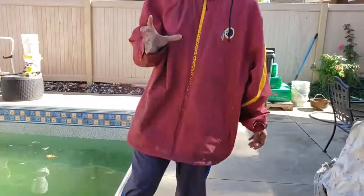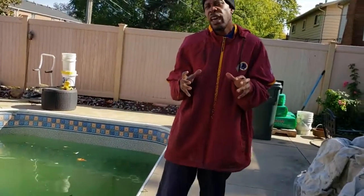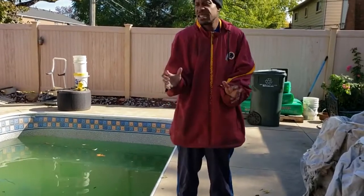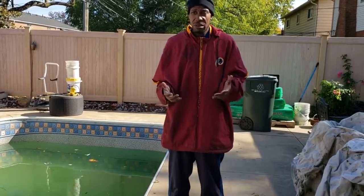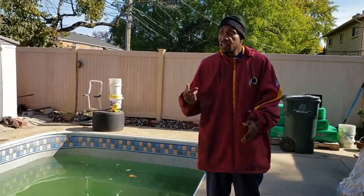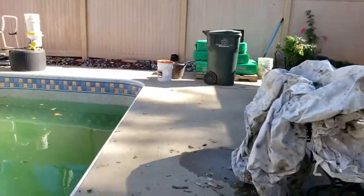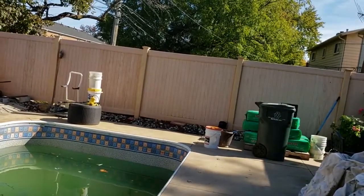I like to stop it when I see it's heavy pink. That way I know there's a heavy concentration of antifreeze right there. So if there's any water that may have backed up or may seep in from someplace, maybe I got a cracked pipe on there I don't know about, whatever. Heavy pink is the ideal time for you to stop blowing. Don't try and blow it all the way through. That's why you have a couple extra gallons. So you're going to put one more gallon in, make sure it's good. After capping it, back on the other side.